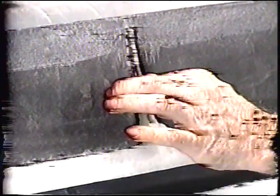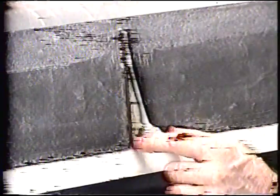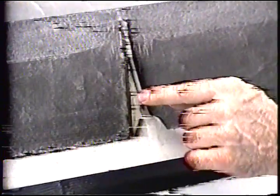We also T-taped previously and then put in the ribs. Well, Misha did it a little differently, and I approve of the method. He installed his ribs first, trimmed them down to match, and then his T-tape picked up a portion of the rib on this side. Now, they are only microed in. In the previous bit of tape, they were 5-minute epoxied in place, which is still approved.